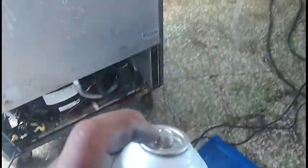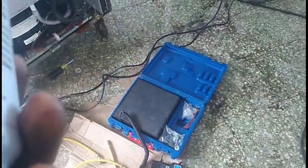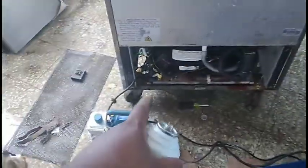Normally with the kit you'd put the punching valve on a container, put it on the scale, and just weigh in your charge. But I don't recommend the piercing scissor — it punched the can but made a big mess. Next time I'm going to see if I can buy a top puncher instead. It's a learning experience, but I think it's up and running. I'm just observing everything to see if the temps come down. It's alive — not bad, been about 15 minutes.